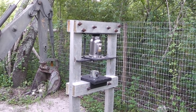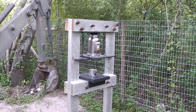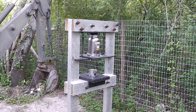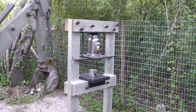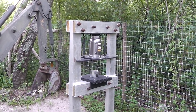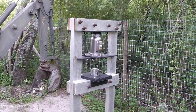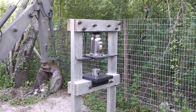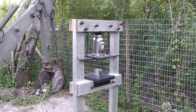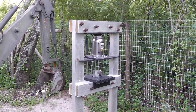You know, there's service manuals online for various hose crimpers, whether you want Eaton, Gates, Aeroquip, Dayton, whatever. I looked at all of those. I looked to see how hoses were crimped. I figured my best line of approach was to buy a die. So I bought a die for 3/8 hose. They're on eBay. You can buy all kinds of different brands, I saw some for $77, $80, $90. Of course, you can buy new ones, but you're going to pay a lot more money for them.